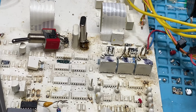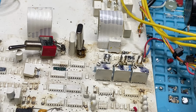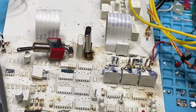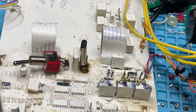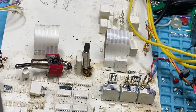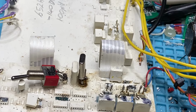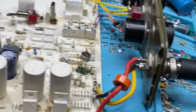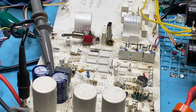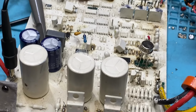And what happened is that somehow I must have mistakenly had it on, and I think I shorted something. So when I turned it back on, channel 2 was dead, and I'm going, what's going on here? So I had to pull the damn thing off again, and I couldn't see what was going on. All switching output was gone, so I had to replace the 4066, and I put it back together, turned it on, and it bloody worked, thank God. So, yeah, that was my drama, a big time consuming effort. So anyway, guys, the first thing about doing your 2000, fix the power supply up.